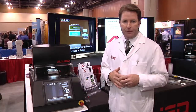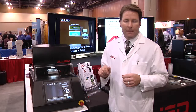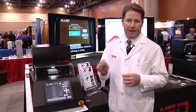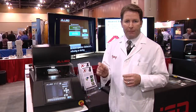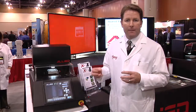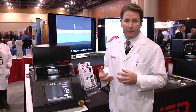The 3D module allows you to map a surface contour, and from that data, machine following that contour. So the diamond tool will then shape the silicon to the original profile. That profile can then be measured externally or analyzed through another instrument, and modifications to those points can be made and then imported back into the tool.